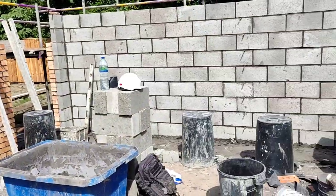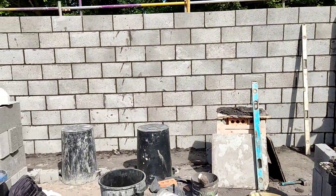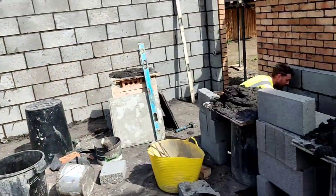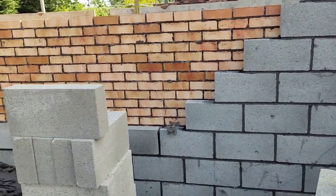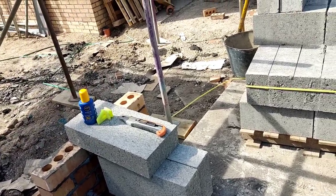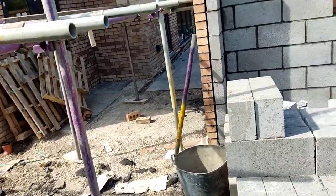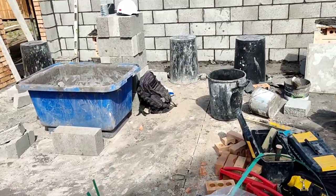So I built all four corners today freehand, as you can see, and I just ran that in. Back wall up, it ties in, got that part way up. And I've probably got enough blocks to just get this up sort of maybe 8, and then just enough to finish. This little pillar is only like a 1.5-block pillar, so I'm going to get that up tomorrow, do the brick. Obviously he's got scaffolds already up, so I'll just work under the scaffold. A little bit of messing about tomorrow, and then bang this 6-inch middle wall in, so, right.